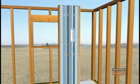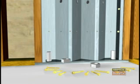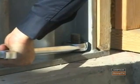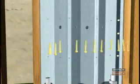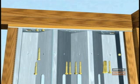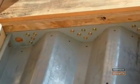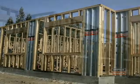To install the Steel Strong-Wall, the first step is to place the wall over the anchor bolts. Next, install the nuts that are provided for you in the hardware kit. Please note that a snug, tight fit is required. Use a hand wrench or socket. Do not use an impact wrench. If required, place an additional shim between the Steel Strong-Wall and the wall framing top plates. Finally, attach the wall to the top plates with the SDS 1/4-inch by 3-1/2-inch screws that are provided with the Steel Strong-Wall. Here is what the Steel Strong-Wall should look like when it is correctly installed.